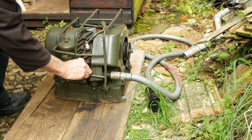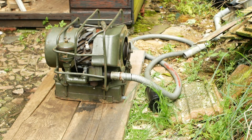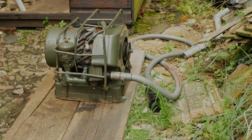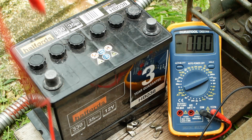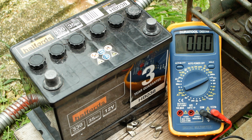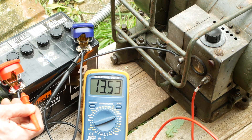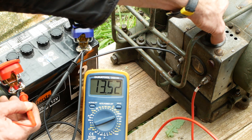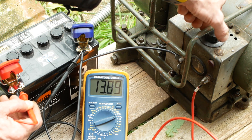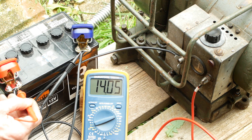It's quite loud — if I'm planning to display this engine at a few shows I'll need to make a secondary silencer or my neighbouring exhibitors won't like me very much. Next, it's time to see if the generator part is working. The battery is a bit neglected, showing 11.9 volts disconnected. With the rheostat turned down it's reading around 13.5 volts, and if I turn the rheostat up you can hear the engine load up and we get just over 16 volts. It's a bit of a brute force charging set — you wouldn't want to leave it running all day without some load on the battery or you'd end up cooking it.